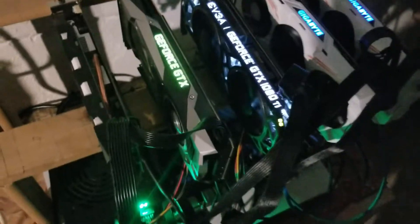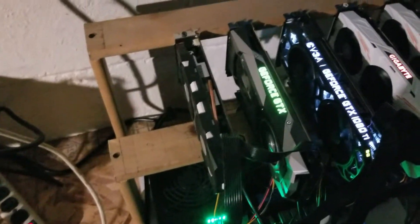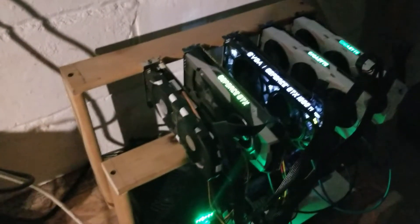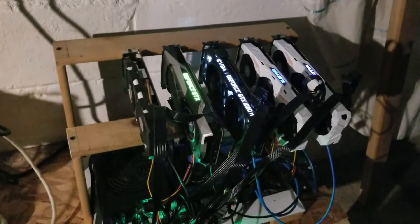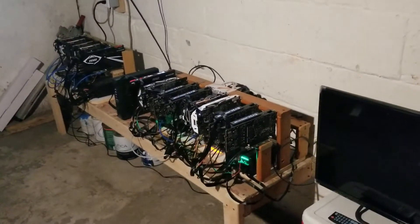And lastly I have this guy over here — I have three GTX 1080 Ti's, a single GTX 1080, and a single GTX 1060. The reason why I don't have a card in that slot is because that's a 1200 watt power supply and I didn't want to push the power too close to the limit, didn't want to burn it out or reduce its lifespan. So this miner right here is pretty heavily undervolted just to be on the safe side.